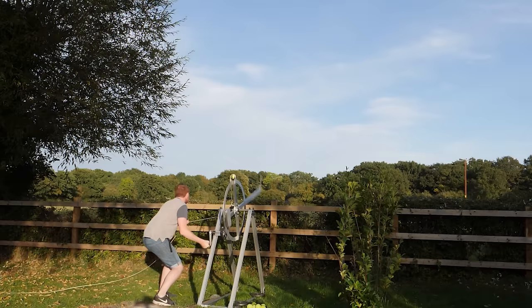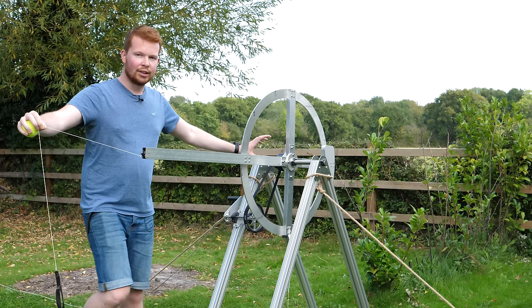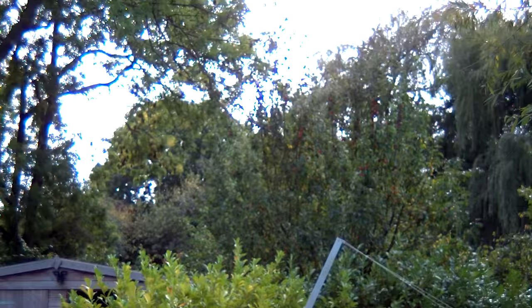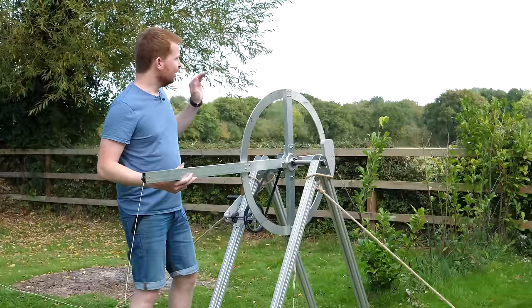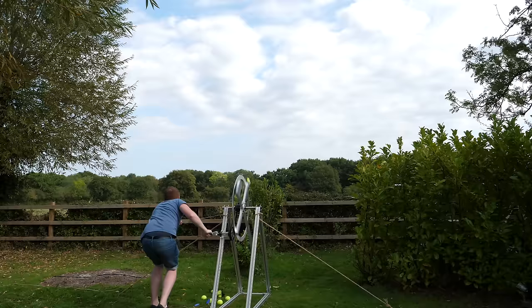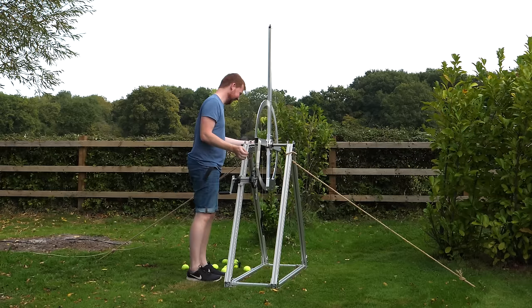The fact that a human can hit a tennis ball faster than this is just insane. So today we are going to beat the world record tennis serve. I reckon the most optimal release point is when the sling is in line with the arm, because then it's at the largest radius from the main axle. I've set the trigger to release the ball earlier, drop from the arm earlier, and then the sling to open up later — so it should have the same trajectory but hopefully slightly faster. I didn't even see where that went — managed to snap the sling though. Let's check the high-speed footage.